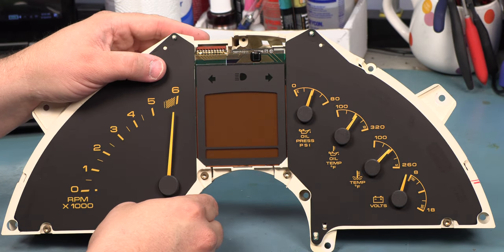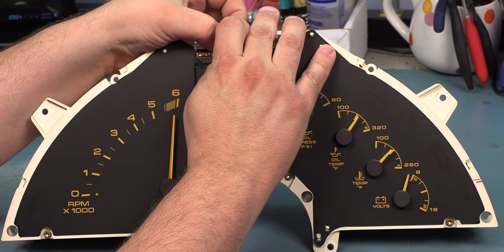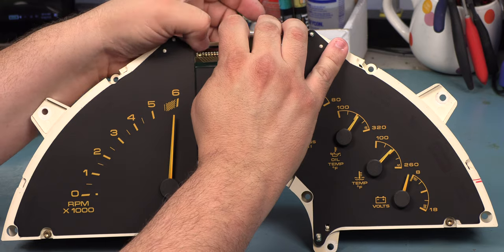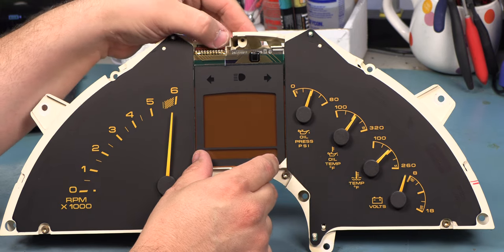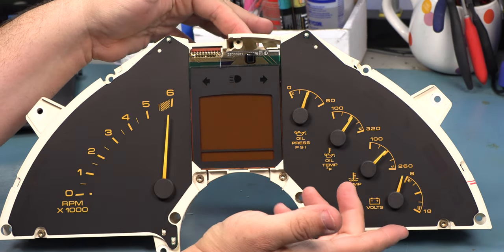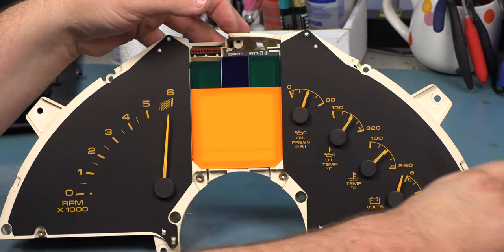Next, we're going to remove the LCD panel. We're going to be very careful with this. We're not going to use any metal tools to pry the LCD panel loose, no matter how stuck it is. We're going to hold the red connector at the top, and we're going to gently lift the glass away. We're pulling it toward the camera. One thing we need to be careful of are these two tabs. We need to not pry the panel forward so that we break the panel in those two tab locations. So we're going to pry it just a little bit at a time, rocking that connector back and forth until it comes loose. And we're going to stop right there. Don't pull the panel any further. Next, we're going to lift the panel at the bottom. And we're going to set it aside.